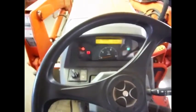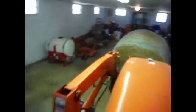Overall, this is a great tractor and I highly recommend it. I've had no problems with it. You'll run out of traction before you run out of power, so maybe a little more weight would be my one request. You do need to fill the rear tires with fluid, and I like to keep a heavy ballast when moving bales of hay or doing dirt work with the bucket. I have a seven-foot box blade back there, and I had a friend weld on a seven-foot piece of railroad rail across the top that gives me close to 300 pounds of additional weight. Thanks for watching this review of the Kubota L5240.